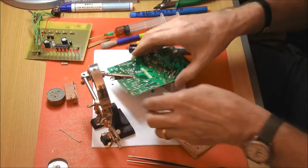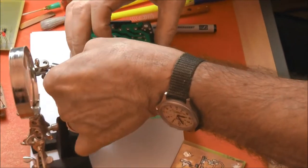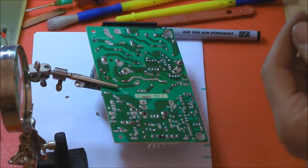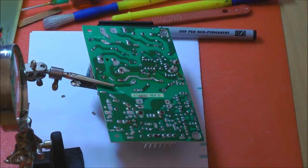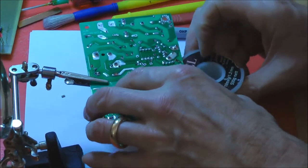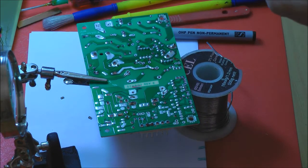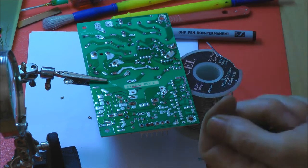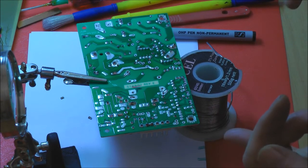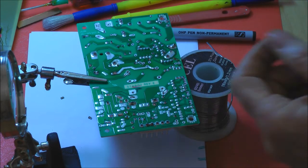There's a lot of devices now which are microprocessor controlled for testing components. Most times, with a transistor, you use a diode checker on a meter, and you check your two diode connections inside. We have quite a lot of fancy things with 3 leads. You plug it on there, it'll tell you what the device is and which lead is which, and it's a lot quicker because you not only know that you've got 2 diode junctions, you know it's an N-channel MOSFET enhancement mode device.